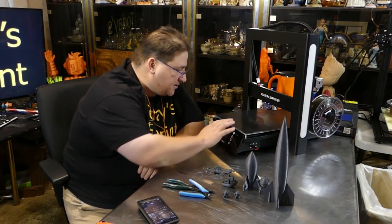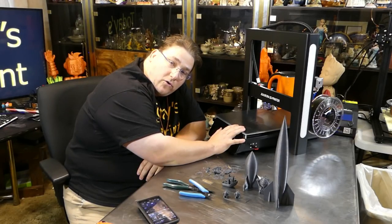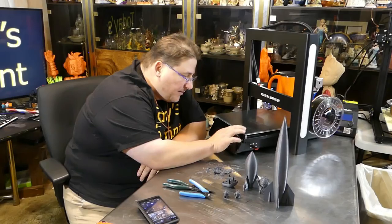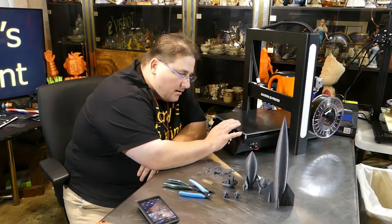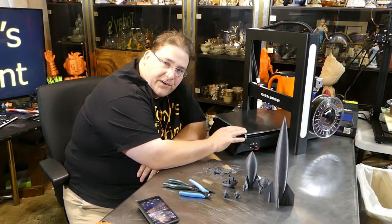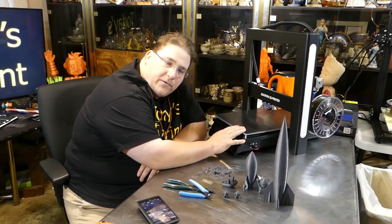I love it. It's great. This is like the Anycubic Ultra Base — it's slightly different though. The pattern is slightly shallower. The prints actually stick to this a little better. You still need to wipe it with alcohol; any residue will prevent stiction. I tried the power-off resume — it worked.